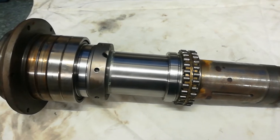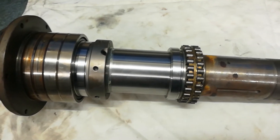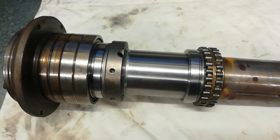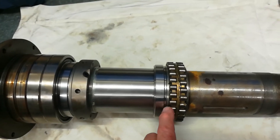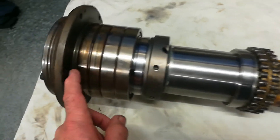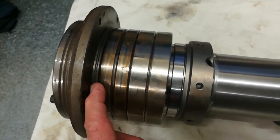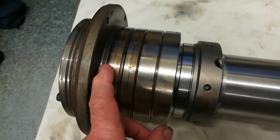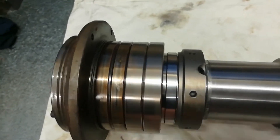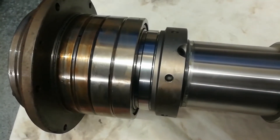Luckily I can bring you back for what you could call video 1.5 - I didn't have to bring you back for a second part. You've got the spindle in front of you - this is the workings inside that spindle housing we were just looking at. I've pulled the shaft out, which is good for a couple of reasons. I can have a visual inspection now. There's an O-ring up at the front that I'll want to replace - it controls contaminants entering the housing. These sort of things dry out over time. The bearings are good so far, absolutely spot on - it's good to get it apart and know what they're like.